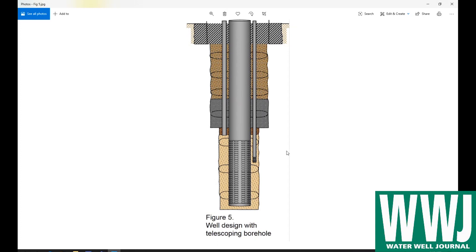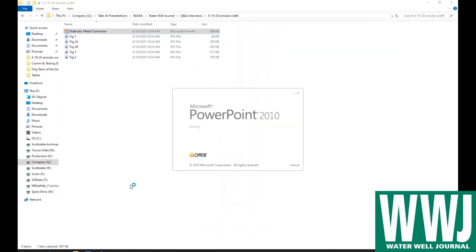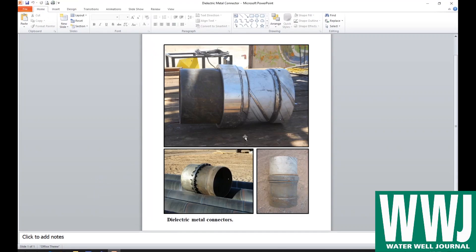There's one other item not shown in this diagram that we may encounter. If we want our well screen to be stainless steel or some different metal than our upper casing, we may have a place where we're connecting dissimilar metals — say, low carbon steel connected to stainless steel. If you weld them directly together, you're going to have galvanic corrosion, and that's going to really shorten the life of the well. There are devices to prevent that. I've got a photograph of some of them here — they're called dielectric connectors. This is an older one with an actual flange and bolts.